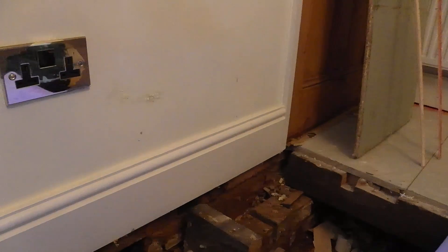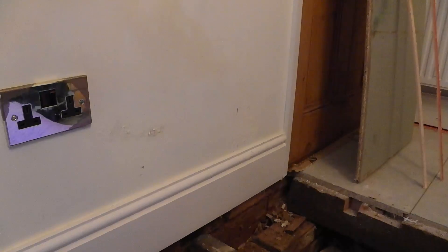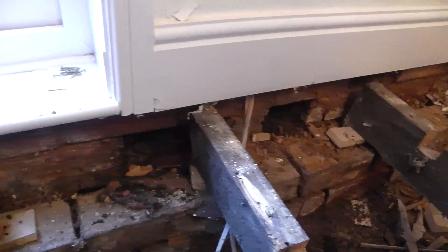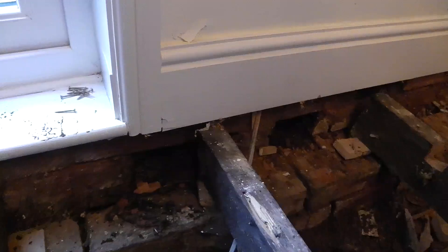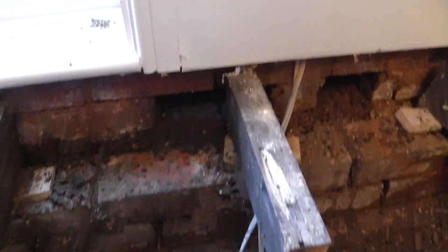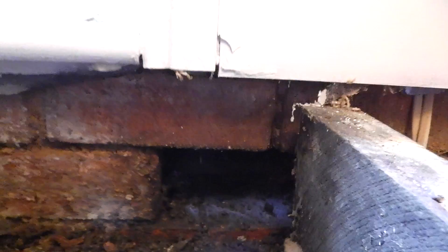This is a very common mistake made by so-called professionals in the industry - no attempt to cure the original issue whatsoever. If they'd done it outside, in time this would have dried out because it would have stopped the moisture coming up, but all these floorboards would just continue to rot away underneath. So: clear the airbricks, lower the level - job done. Now for the first time we've cleared the debris around, you can see natural daylight coming into this hole from the outside world. All this black stuff is soil - not hardcore, not base course, not mortar - just dirt and water.